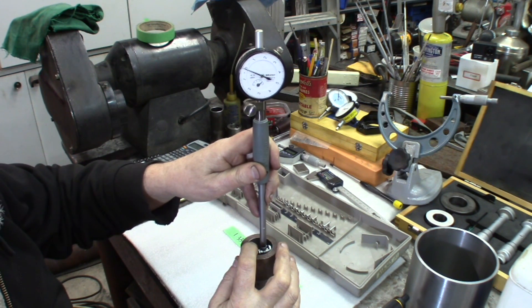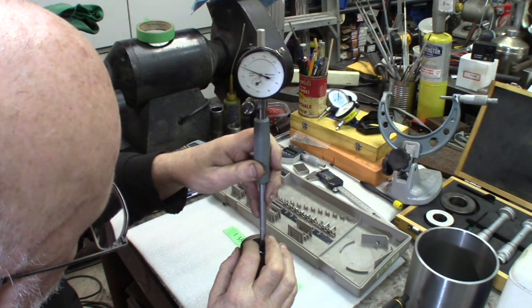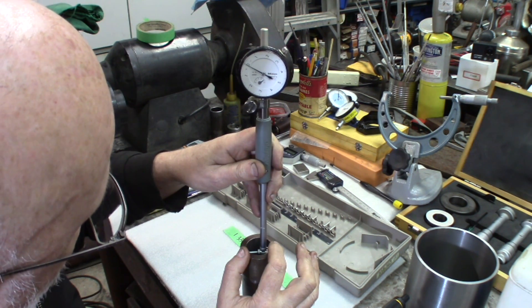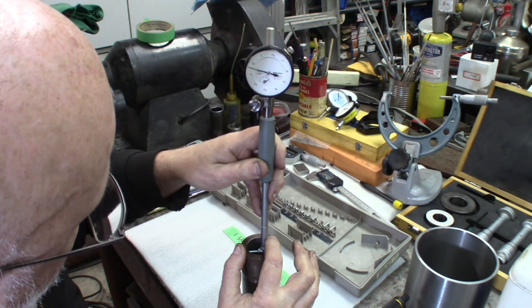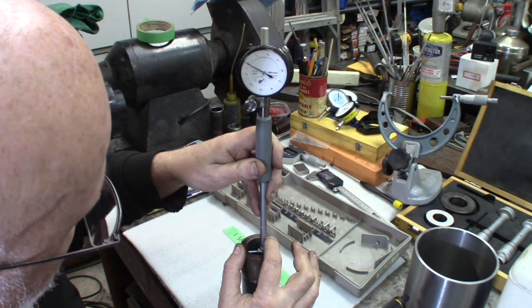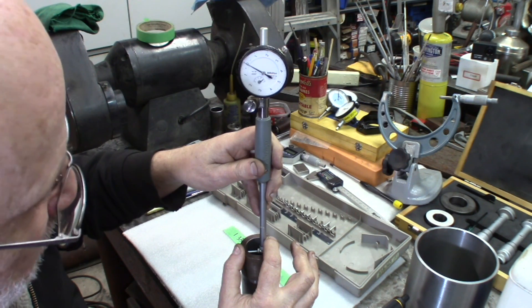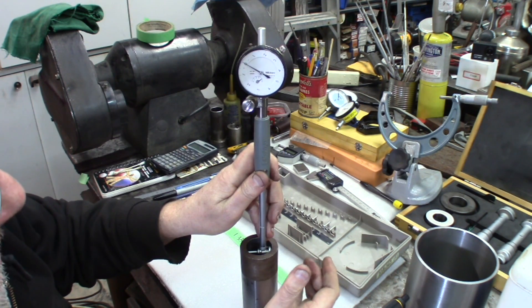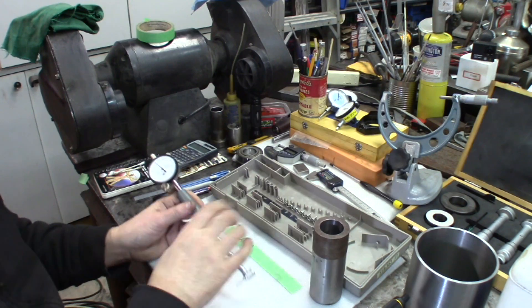So, we're going there and we're pretty near the zero. At maximum deflection, we're getting about half a tenth of a thousand. We're getting zero — that's good. So at full maximum deflection, we're getting exactly the reading on the micrometer, and this cylinder will be exactly in the specs. We're measuring exactly the same thing. That's pretty good.